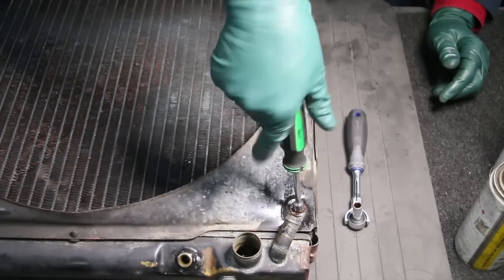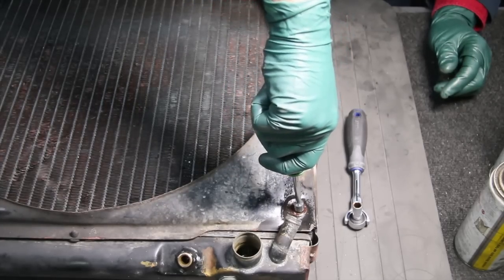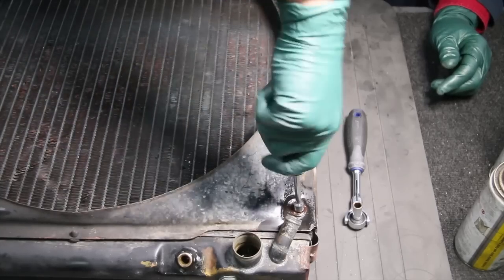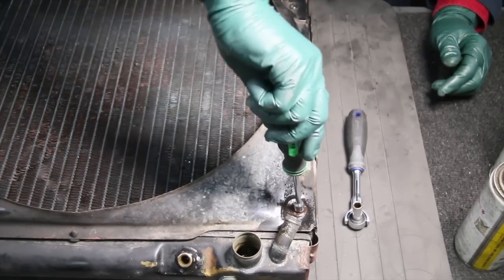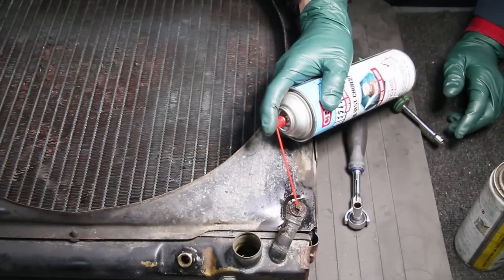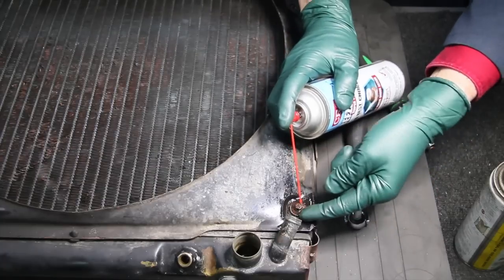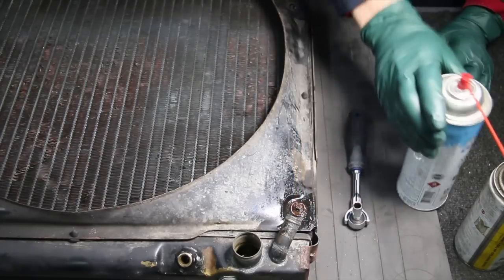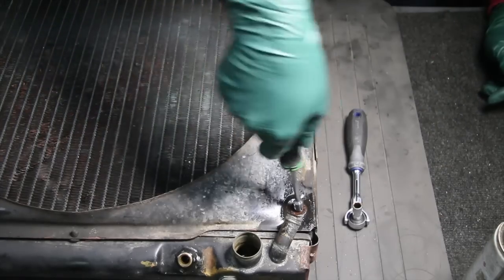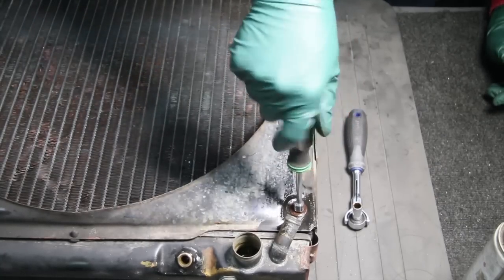Back down until it's loose, back out until it's tight. This time I'm going to turn it about another half turn, then turn it in, then bring it back. Each time going another half turn out. I'll go ahead and add a little bit more penetrant — I've already got it sticking up about an eighth of an inch, so I can really get the penetrant down in there. You understand now why I like to use this nut driver? All right, now it's coming out.